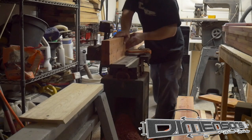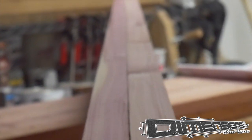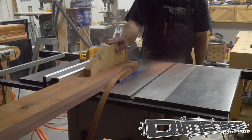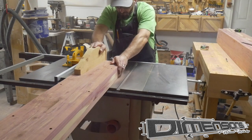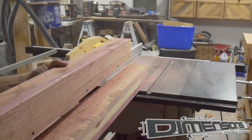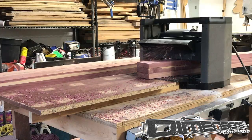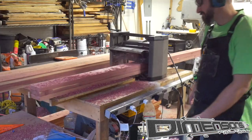After letting the glue cure overnight, I removed all the screws, then took my laminations to the joiner to get a true face to reference off the table saw fence, trimmed that slight edge off the outside so I had two square edges, then I made the cut right down the middle for these two four inch wide boards that I needed out of the eight inch lamination. Then I took the pieces that were at their final width, skip planed them, and ran the faces over the joiner again to get four square true edges.